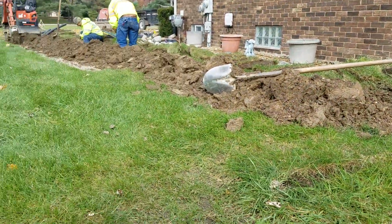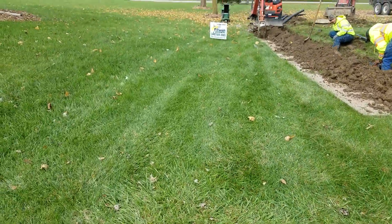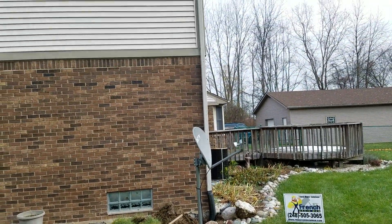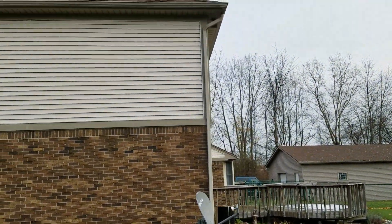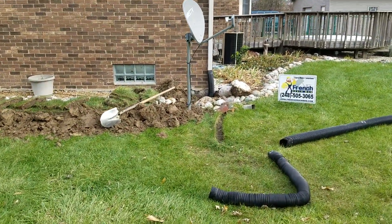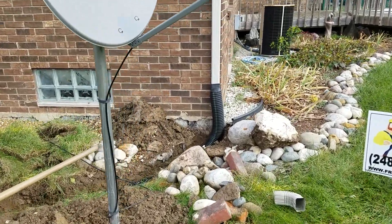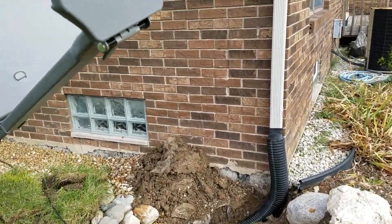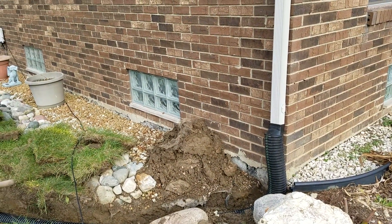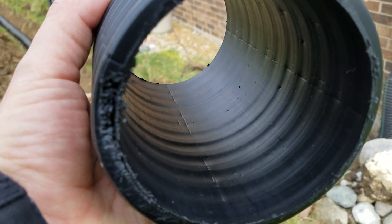We're trying to get the water away from the side of this house — it's pretty flat in here. That one downspout is going to be run 95 feet. As a two-story house, we're going to be at about 9 PSI on a moderate rain by the time we get to the bottom. I like that, I'm real happy with that. On a really heavy rain, that increases — the higher the volume of water, the more pounds per square inch.